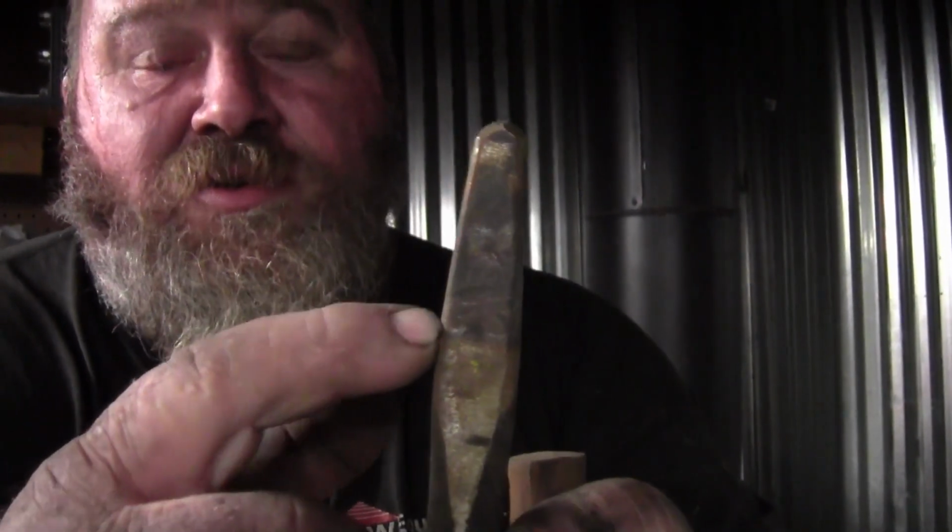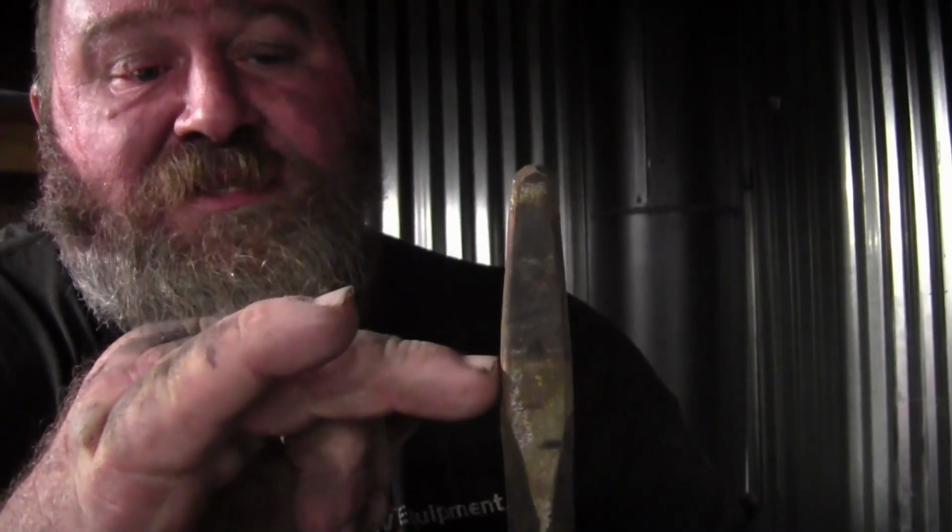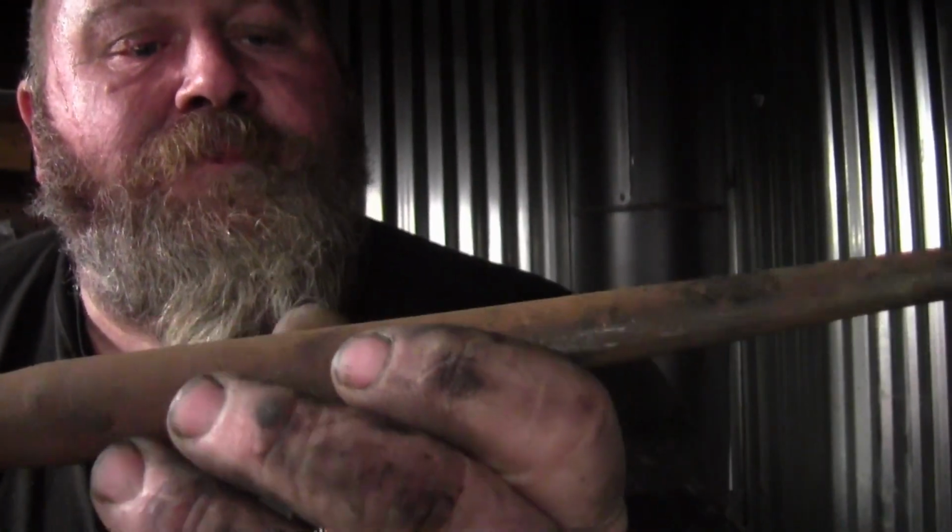I mean, I punched some hammer eyes with, I've got a tool that I made to punch hammer eyes with, which is, I don't know if y'all can see that or not. It's just for a small hammerhead eye, and you'll punch down to this point. This is a piece of coil spring straightened out. You'd punch it one way, and then you flip the piece of steel and punch it the other way, and a slug comes out. And then you would size it to your hammer with this hammer eye drift, and this is specific for the size hammer that I was working on.